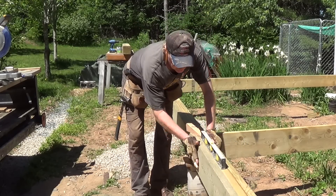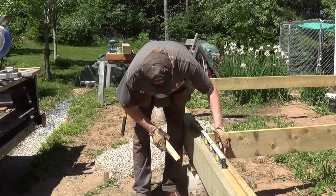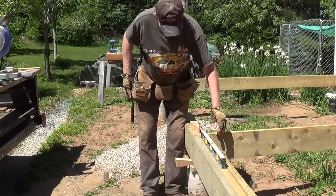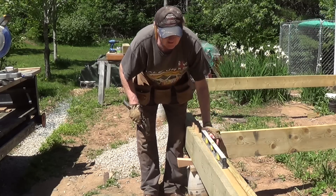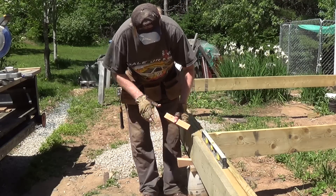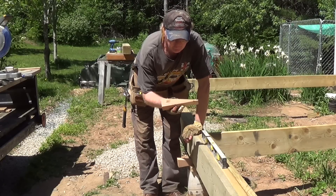My beam's level, but I've put them off of here, taking the pressure off of this. What I do is just stick a wedge to take some pressure off that. Whenever you're doing any building, it's always great to have a few wedges around — they'll help you out a lot.